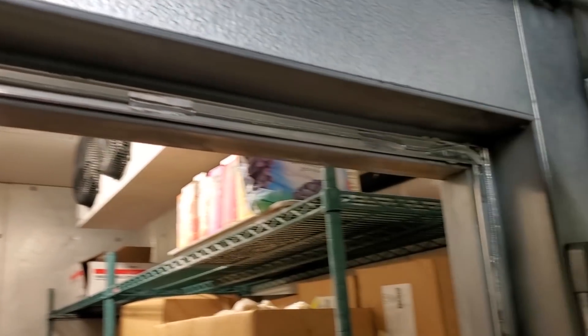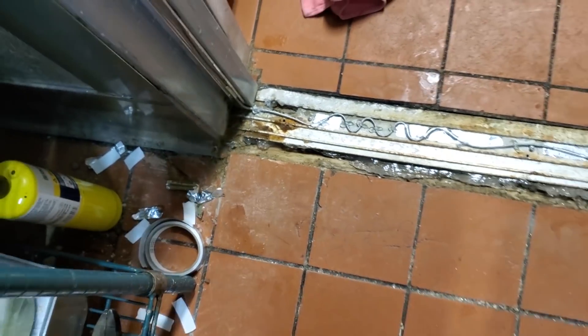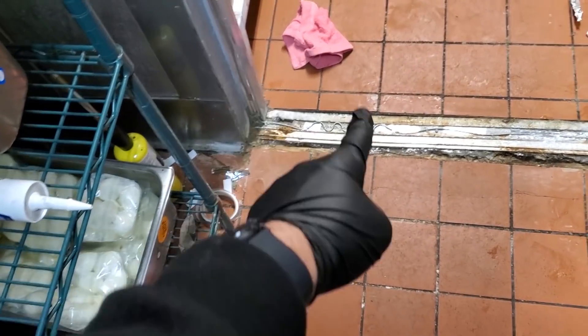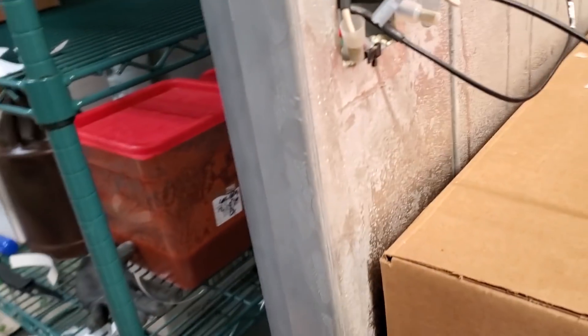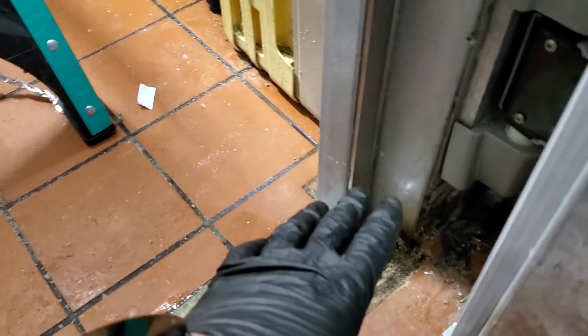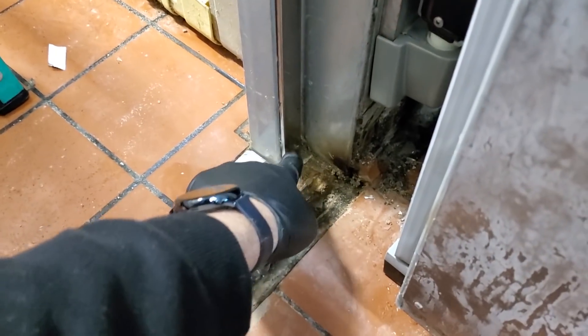It's not the prettiest thing but it's going all the way down to the bottom. We had a little extra heater so we had to spool it up right here, then put the threshold down with a couple dabs of silicone. The track is always a pain — you have to notch out the bottom corner so that way it doesn't pinch the heater off. But we got it all in. We went with the factory heater track, so it makes perfect corners up in here.